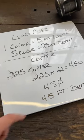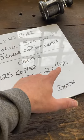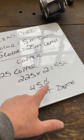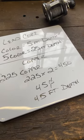For copper, if we've got 225 feet out, what you're going to do is multiply 225 — or whatever length you have — times two. That gives you 450. Drop that last number, and you get 45 feet down. This is going to get you right in the ballpark, and you can just adjust from there.